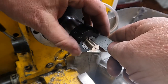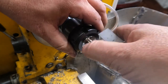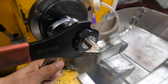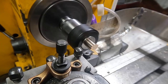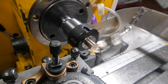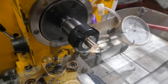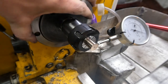This is an MT2 taper chuck that I bought for the rotary table, and I haven't really used it in the mill. It's in an MT4 adapter here. Let's put it in, get it tightened up, and then go to face it off and turn it. My camera mount here is still a bit shaky, but you can perhaps see what I could see there, which is the parts wobbling in the chuck. When I check it, I got like 10 thou run out on the part, which is completely useless.